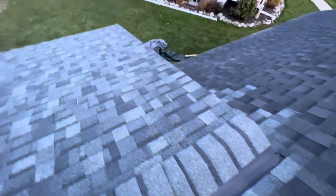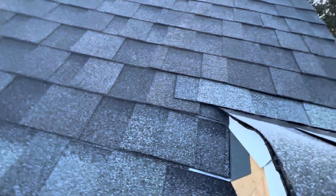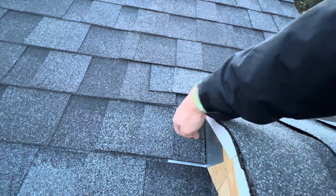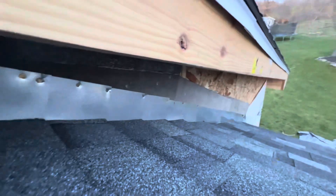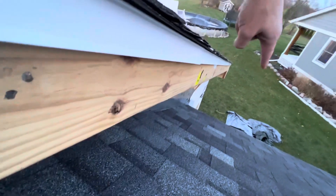This is how I finished the intersection of this roof — I believe it's the right way. What they did is extended this flashing out over the drip edge, which will bring the water down, hit this step flashing here, and continue down onto the shingles underneath, which are flashed. Ice and water shield and step flashing all the way down to a kick out flashing at the bottom.